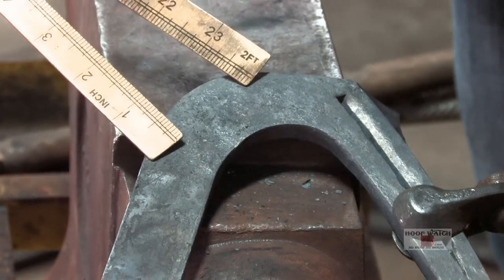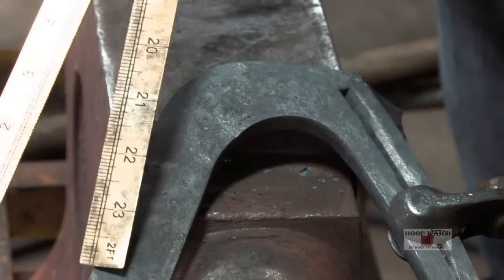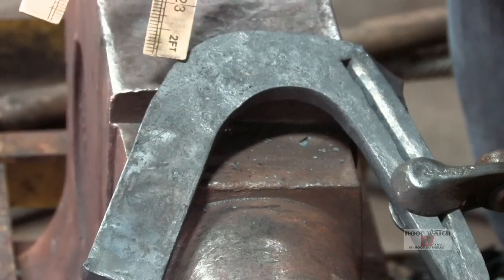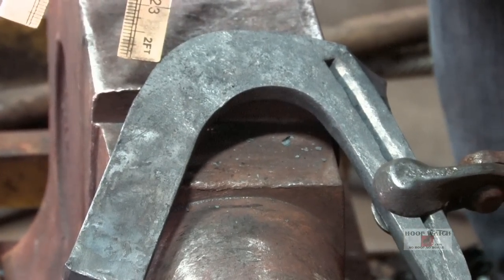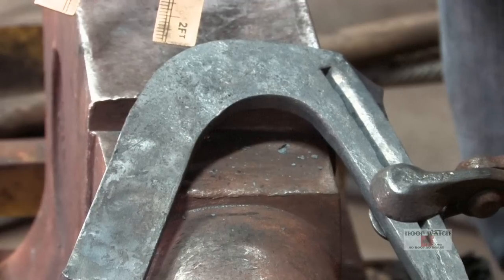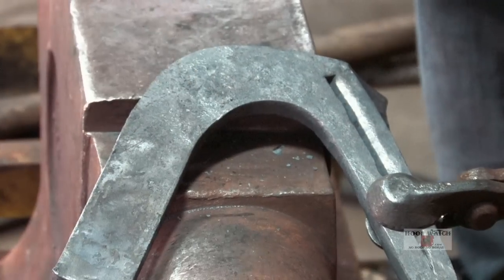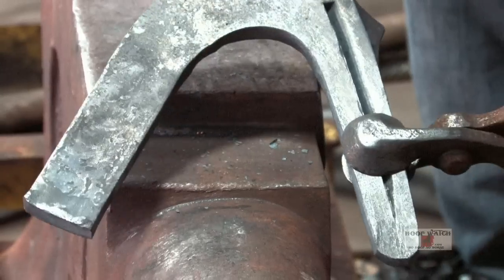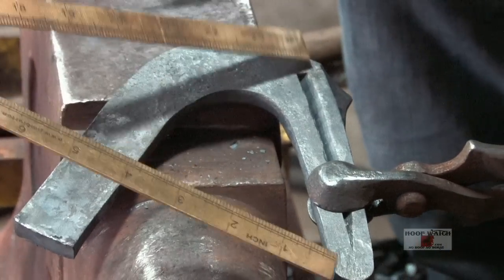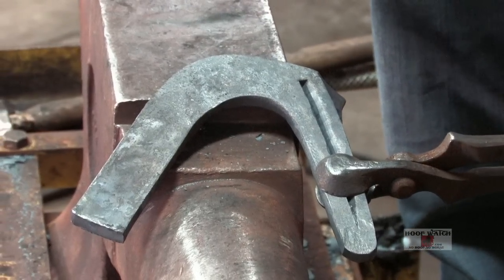So now I'm thinking that by the time I forge my branch and put my heel on there, I'm going to come to the bottom corner. But if I thought I was coming short, I might come to the top corner of that blob to adjust for the other side of the toe, to compensate for the length of the branch. Because this side is completely forged. This side has no forging and we're almost a symmetrical shoe at this point.